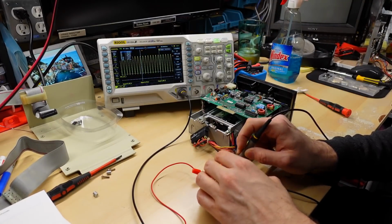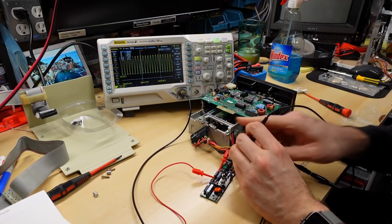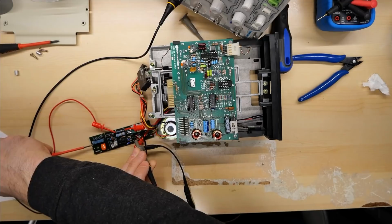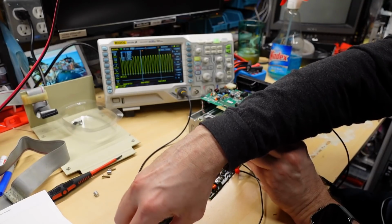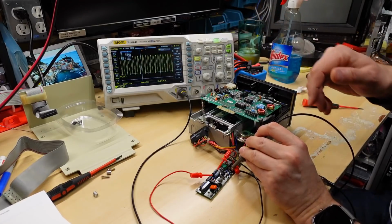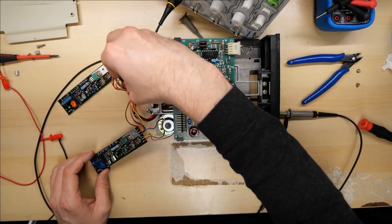and we're getting 1.69 kilohertz or thereabouts. And just so everyone knows, I'm going to adjust the adjustable potentiometer here, and it has absolutely no effect whatsoever. Yeah, I'm turning it right now, and it's not doing a thing. So actually, yeah, 1.72 kilohertz.